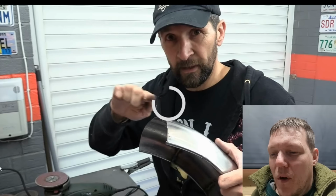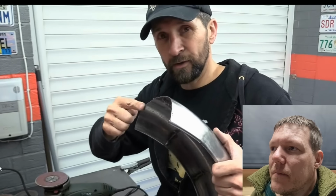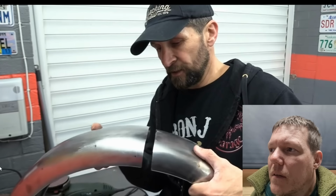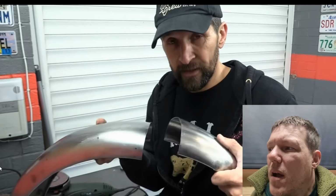It's all important. Not one is more important than the other. So if you're going to melt them into each other, they need to touch all the way along. That's the point. TIG welding takes so much longer as an overall process because getting the joint right, getting the two pieces of metal absolutely perfect all the way around is the task.